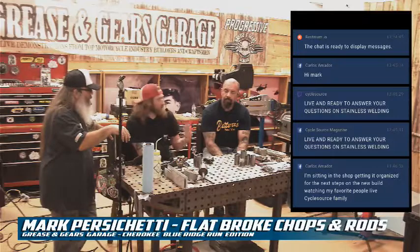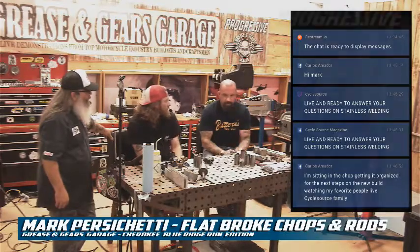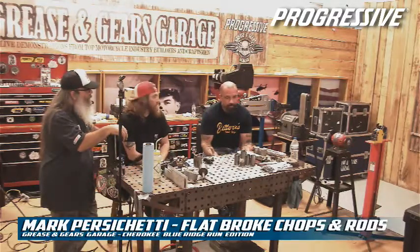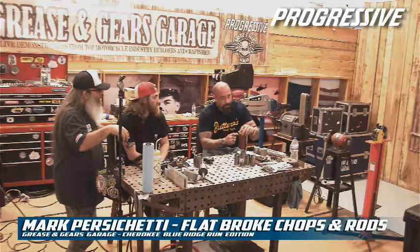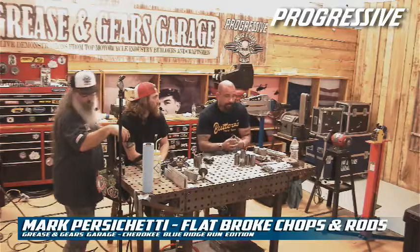It's more of like a process pipe for potato chip factories. Yeah, the proper way to weld an exhaust is the same as food grade and all the stuff in machinery. Purge welding, in simple terms, is when the heat's on the outside of your weld. The inside, when your ends are beveled, especially with a thick wall tubing, can be a pretty thin area that you're filling with weld. So the heat on the inside is pretty intense on that metal. Introducing that argon and pushing out the oxygen on the inside will prevent what's commonly called sugaring, because it looks like black sugar, which structurally is not a good weld.